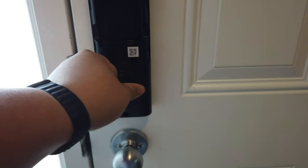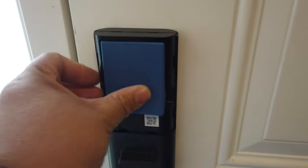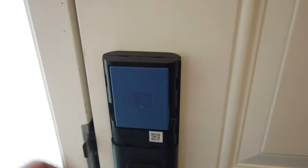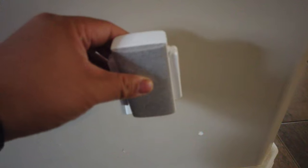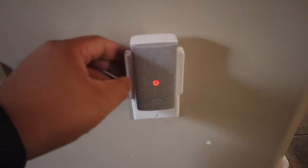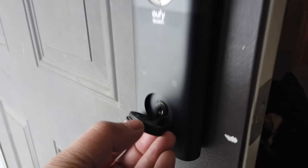Make sure you test out the deadbolt — if it's opening and closing first — and then put on the screw so it won't let go. This is how you install and charge the battery: you need to plug it in via USB-C cable. Then lastly, install the lid by pushing it down. Once that's all done, plug it into the hub right to the wall, and everything will be synced up and ready to be installed on the app. The keyhole is right behind the doorbell slot — if your doorbell is dead and has no batteries, you can also use your keys to open the lock.